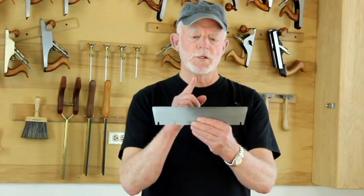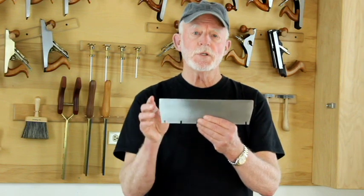Our medium blade starts at 16, goes down to 12 for 2 inches, and back up to 16. You would use this blade for cutting 3/4 hardwood. And our coarsest blade, which starts at 14, goes down to 10 and back to 14, is just right for cutting the cheeks of a tenon on a table stretcher, for example.